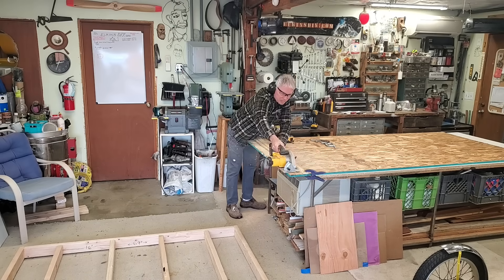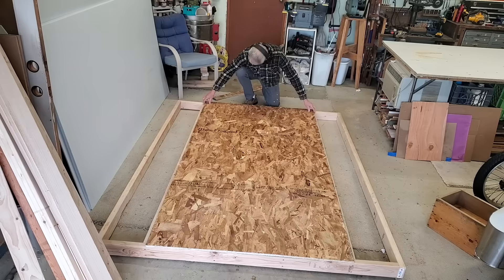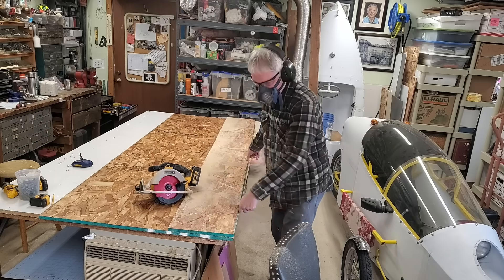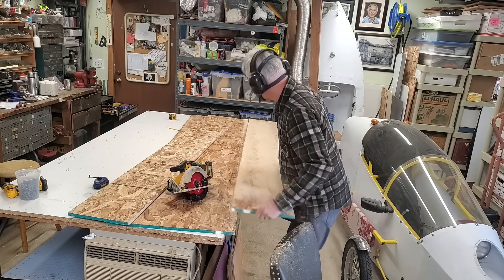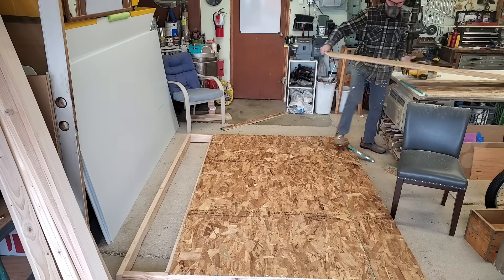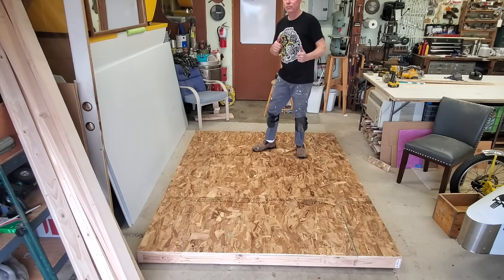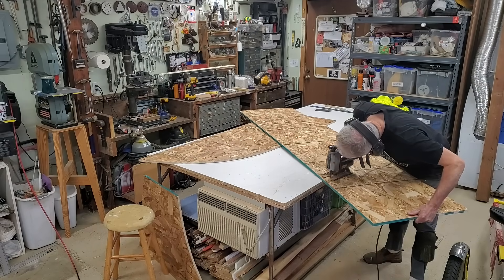Here I'm doing the base floor — I found out this is the best technique. I was trying one project using pallets and that just took forever. Paneling like wood in the building industry is very similar to the food you eat: the less you pay, the more crap you get in it. That's kind of what OSB is all about. It's twenty dollars a sheet for five-eighths by four by eight, but it has a lot of glue in it. The siding I used on my last project — the she-shed — I had T1-11 siding and that was forty-eight dollars a sheet. Anyway, I've used OSB before; you just have to paint it up real good and let it off-gas well.